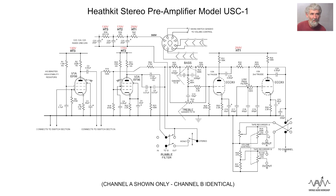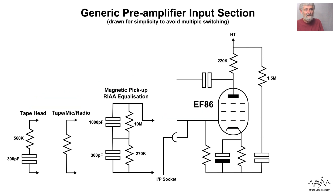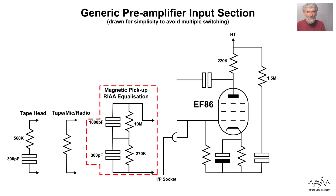I talked before about a simplified circuit around the input valve - we'll now go to my simplified drawing. This should be very familiar from other circuits. In this feedback circuit it's between anode and grid. There may or may not be, depending on which input and which circuit, a resistor here between the input socket and the grid. So here we have the RIAA circuit with these particular values. If you look at different circuits, you'll find different values of capacitor and resistor used, but they all have in common the same time constants.